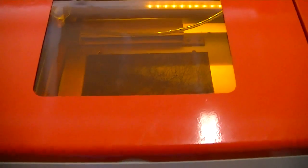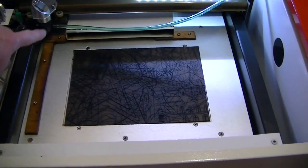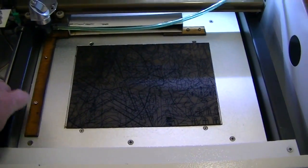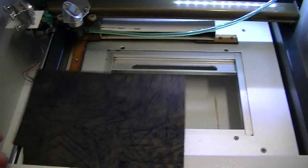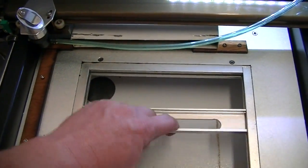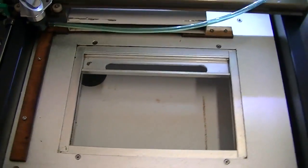Here's the laser itself. I've made a few modifications to mine. For one, I put in an air assist, so it's blowing a little bit of air through this tube, blowing right down into the stock. Helps keep it from lighting on fire — sort of. I've added these rails so that I can put in a piece of wood and I know it's going to be exactly where I want it to be. These China lasers come with this goofy clamp system. Apparently they want you to clamp the stock in there, but this clamp is horrible. I hate it. So I just cover mine up with wood so that stuff doesn't fall down there.